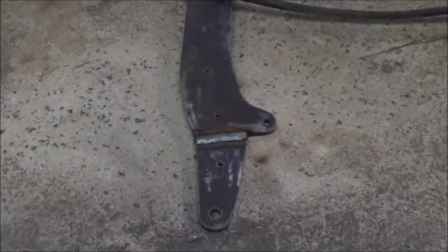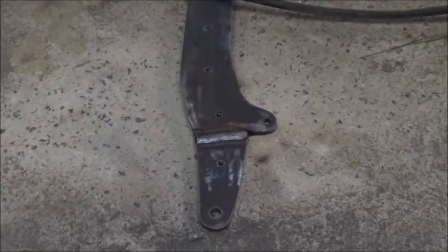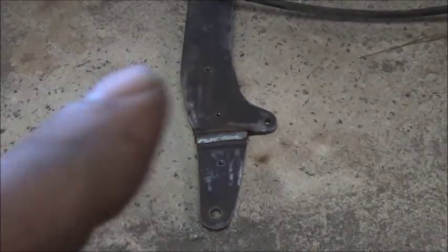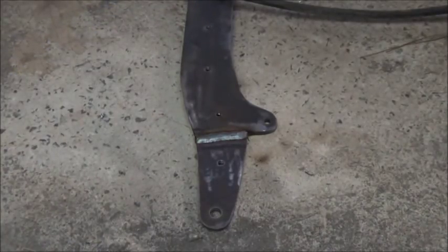Following day, working a little bit on this front end, trying to get all the little stuff tied up. You know, you can fabricate and start throwing stuff together, but if you don't complete anything, then when you go back you've got loads and loads of work to do. So what I'm trying to do is get little things caught up — the little holes welded up, re-tapping the holes on the other end, then grinding these welds and getting it good and straight.